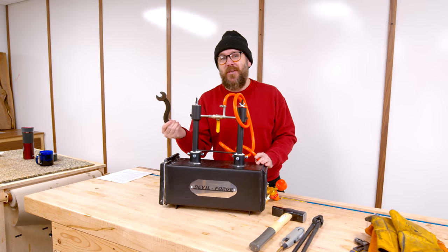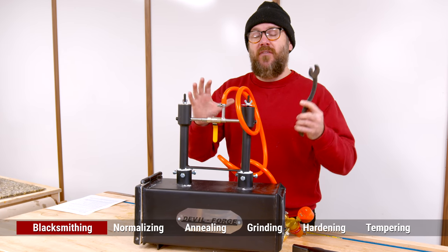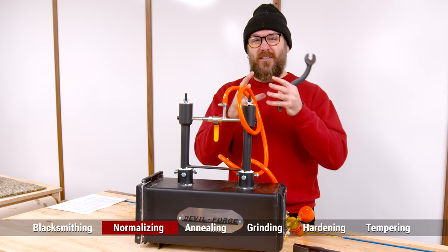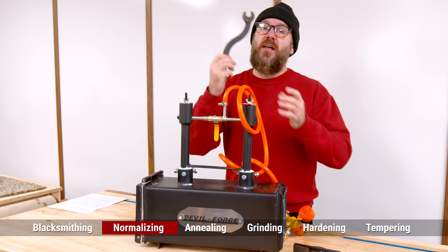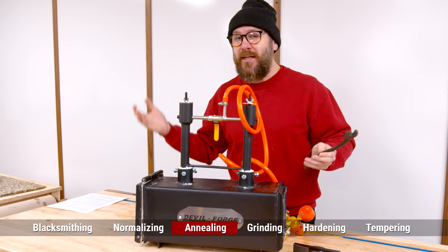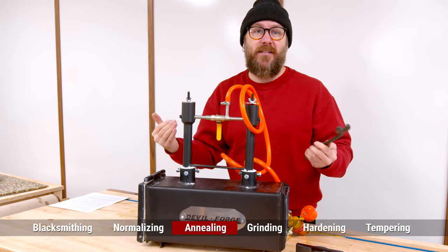This knife isn't going to be used for survival or even used at all. If you were going to blacksmith a real working knife, after shaping you would have to normalize it — meaning bringing it up to temperature and letting it air cool three times at three different temperatures. This resets the grain within the steel and removes all the weak points. Then after that, you have to anneal it, because the steel will be really hard and brittle and could even shatter. Annealing means bringing it back up to temperature and then insulating it and letting it slowly cool over many hours, making it easier to machine.